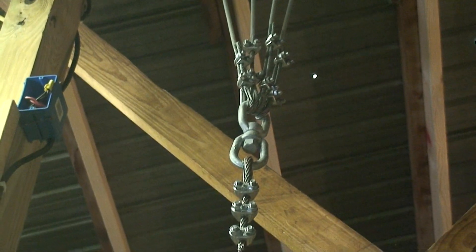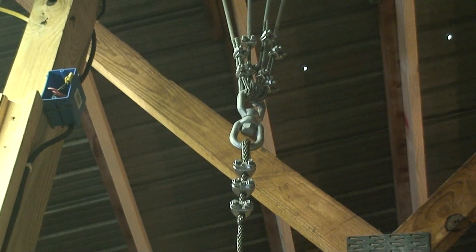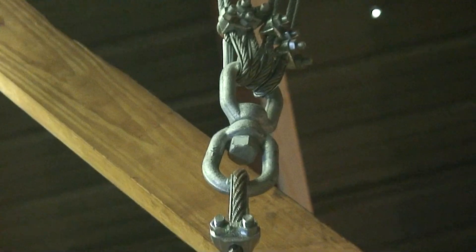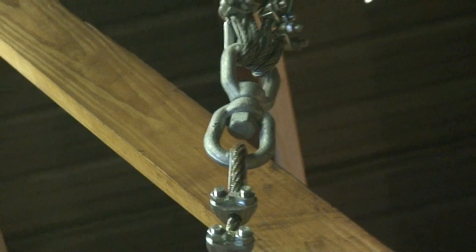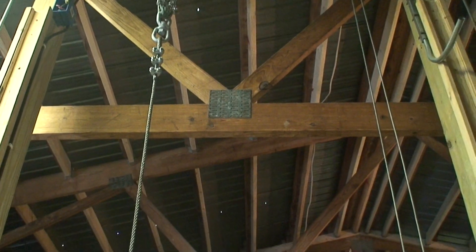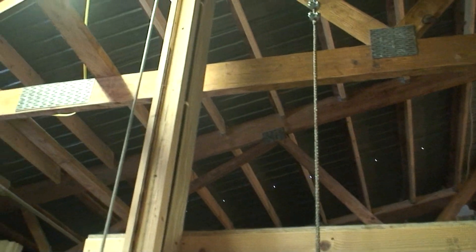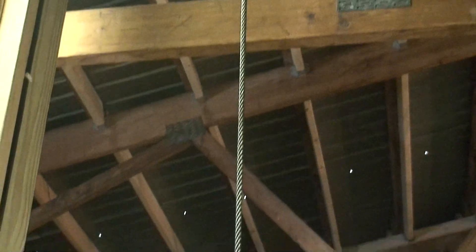When you're picking up your parts, you want to make sure you over-engineer everything by quite a large margin. For instance, this swivel here is rated at about 6,000 pounds working limit. We're never going to have even close to that kind of force on this, but I would buy the most heavy-duty stuff you can afford. The smaller cables at the ends are rated at 3,000 pounds working load, and this large cable here is a 5,000 pound working load cable.